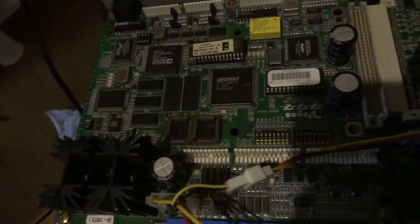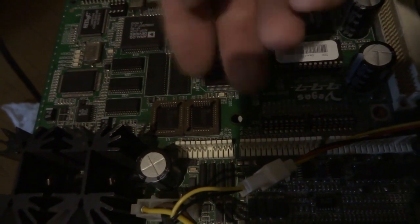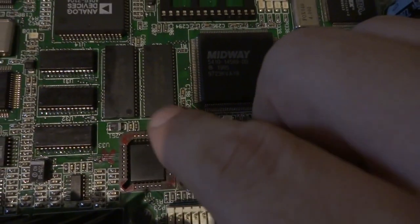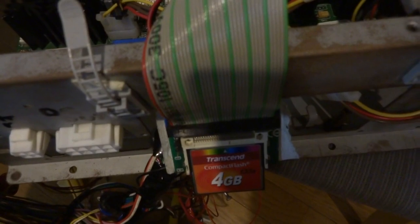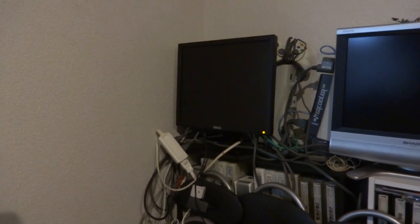It's got a little bit darker out, but what I did is I went around this soundboard — the one I wound up replacing — and started changing out components. The two components I didn't change out were these two decks right here. I got them out of the other board and put in two new ones, and finally was able to get sound. This one here has something involved with it that is just not working — whether it be one of the chips causing it or the saddle it sits in maybe cracked or not making good contact. But when I put the other one in and swapped these two out, I was able to get sound. The only problem now is the hard drive died, and the compact flash I have is also pretty much shot. I'm using a Dell monitor over here on the side.